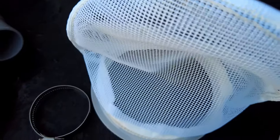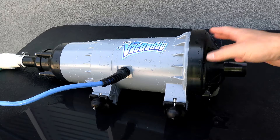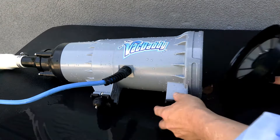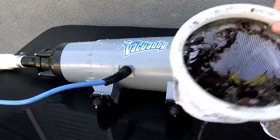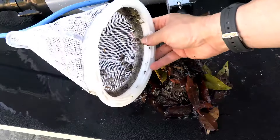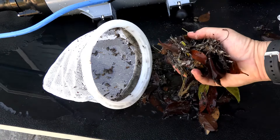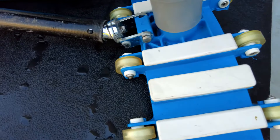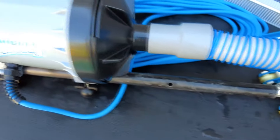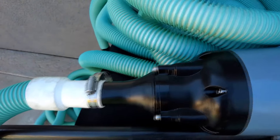The vacuum-to-waste attachment also comes with a leaf bag to put in the Vac Daddy when vacuuming to waste. As you can see, it picked up leaves as well as dirt — all the leaves are trapped in here so the impeller doesn't get clogged up. This acts like the pump basket you'd find on a portable pump. The Vac Daddy version 2 with the vacuum-to-waste attachment is definitely a game changer for your pool route — vacuum out pools with heavy dirt and debris without bringing a portable pump to the side of the pool.